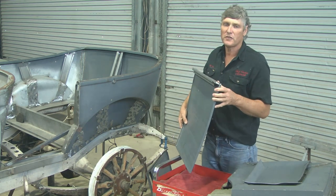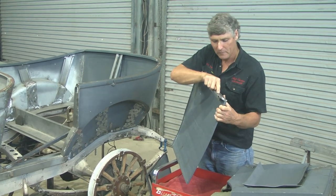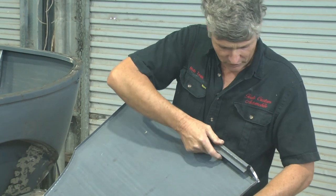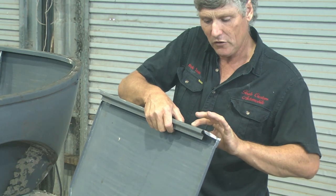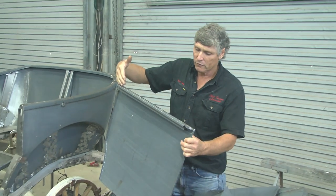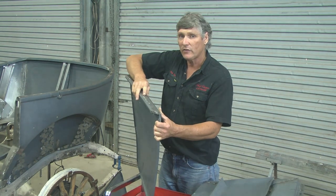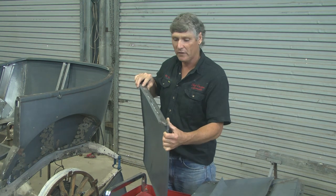This is the top section I've made — the second piece of steel runs from the weld line on the top, down forming this inside edge part of the door, and the lip on the bottom which the frame is going to weld to. It's relatively simple to fold, but there is a little bit of a curve in the top. I folded this on the pan brake, added a curve to it by simply bending it over my knee, and then for the little bit of curve on the top I put one of my tea dollies in the vice and hammered it over the edge to just roll the top of it a little bit before welding it together.